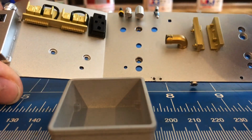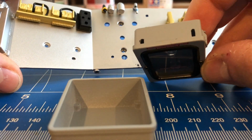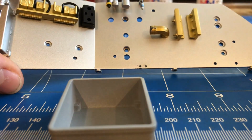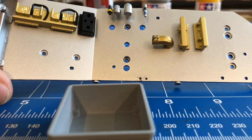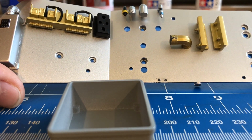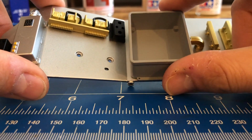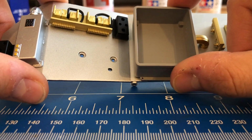There's only one problem. Those two outer pipes have a pin. I'm not that happy with the design of the stock flux, because they made two big ugly holes in them, and I don't want to do that with my box. So what I will be doing is I will just cut those pins off and just put a box against it. And there are several ways to put it in place. You can drill some holes in it and put M2 bolts and nuts to put it in place, or you just make a smaller hole in it and just put some AP screws in it.